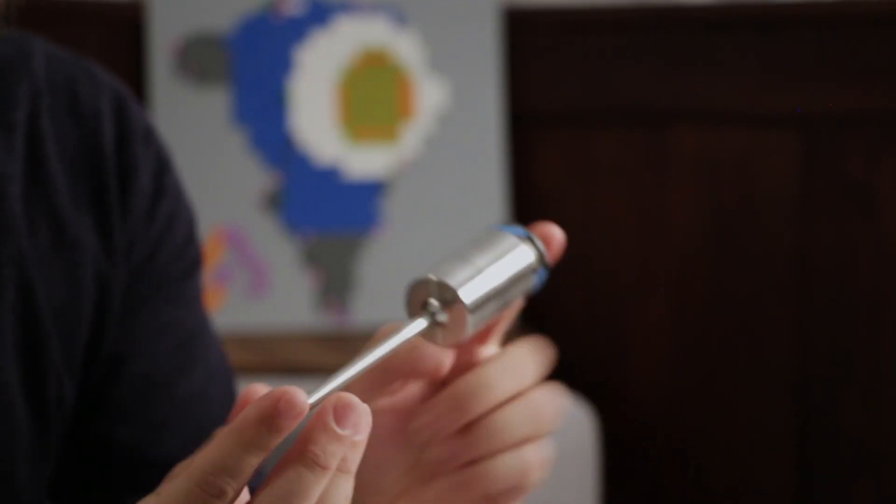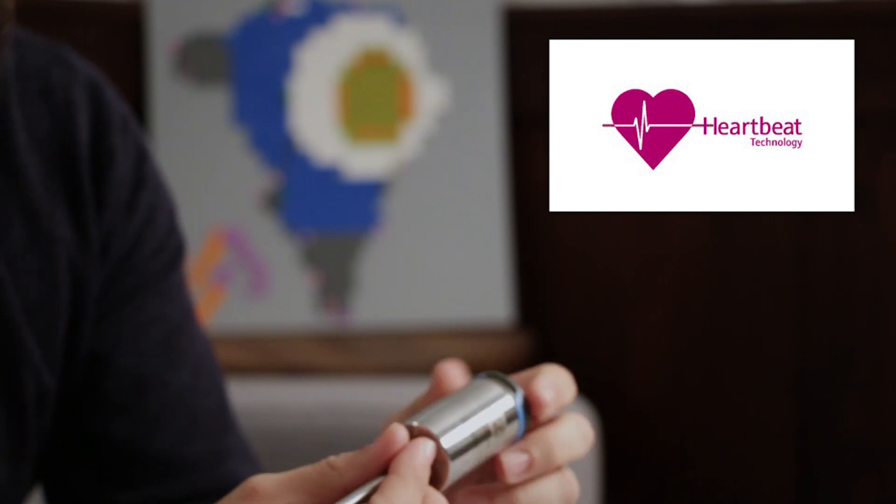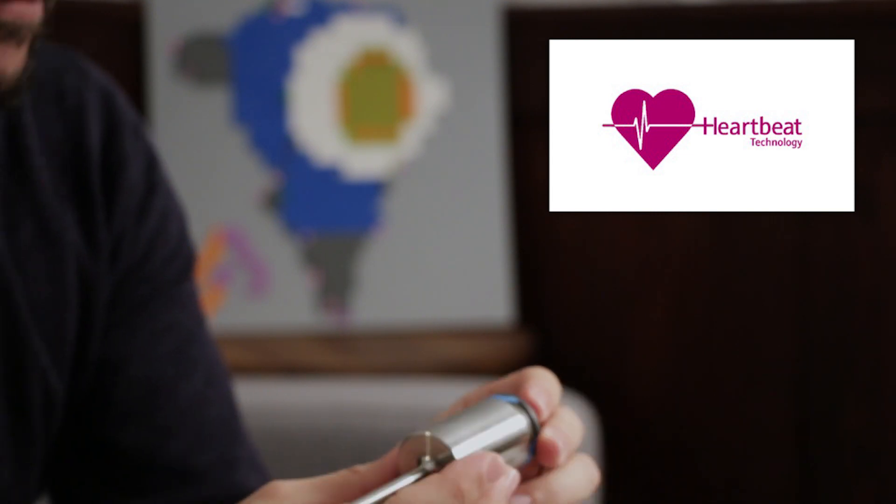This sensor replaces one part of the custody chain needed when you do calibration, since the ceramic body is certified just as it was for the oil vats you had before in your plant. This sensor also comes with Heartbeat, which is an Endress+Hauser technology for diagnostics. And even if you don't have HART and you have 4-20 mA as your communication protocol, you can still use the advantages of the self-calibrating sensor from Endress+Hauser.